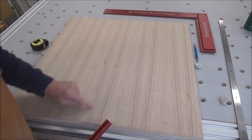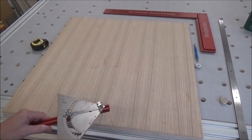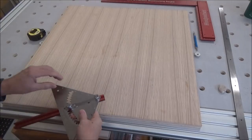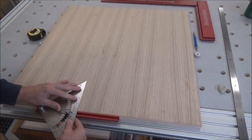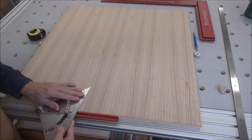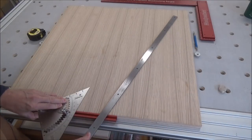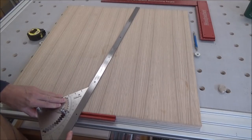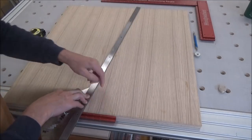I don't know if you can see this line here, but I've got a layout line at 10 degrees, and I used my Woodpecker's TrueSquare — this is really a nice tool — and set it at 10 degrees. I just used a straight edge, carefully brought it up to the edge, and made my 10-degree line right there. Drew my line at 10 degrees.